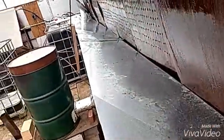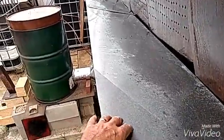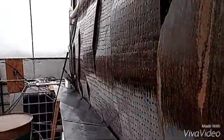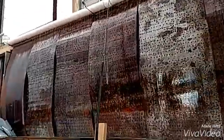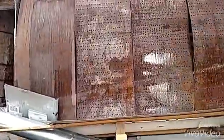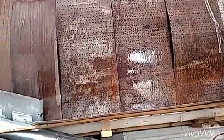Now, I was having trouble with the splashing, so I had to put these panels out here so the water would catch and run back into the trough. But it sure cools good. The thing I like about it is there's not going to be much maintenance on these. Those cardboard ones they use are supposed to work really well, but you've got to maintain them quite often. So hopefully this will work and won't have that expense.